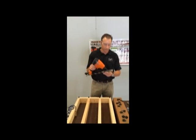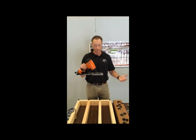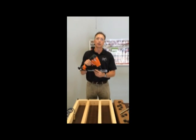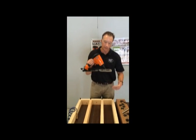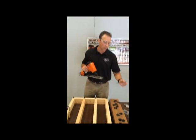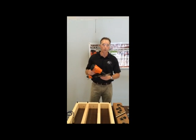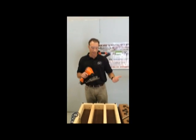One big improvement that we saw, that we were having issues with, obviously this is a nailer by nature. And if you know the heads of nails, they're right angle. Well, the ballistic nail screw that we use is a countersunk head. And what we were seeing was, due to that right angle, we would have chances of jamming the screws at the end of the strip. With about 5 screws left, you would load that new strip in and it would cock those 5 in front of it, and it would jam in that right angle feeder. So what we've done is create a feed rail that is specifically designed with a feed mechanism to handle the countersunk head. So that alone was a huge improvement to the tool. So we've made 4 very nice changes that have really made the tool work a lot better, and the feedback from the contractors is exactly the same.